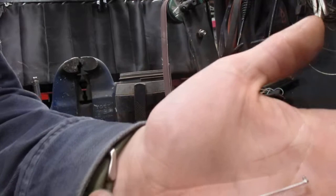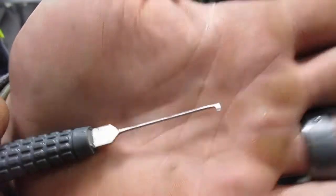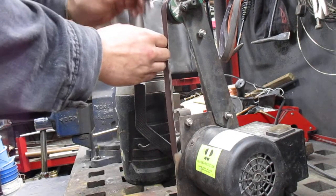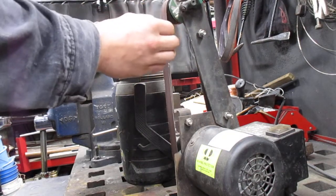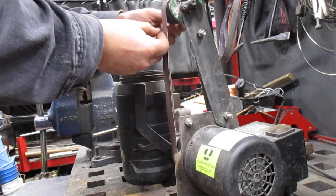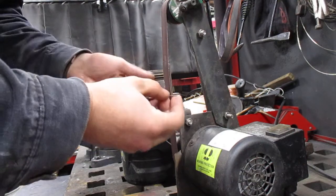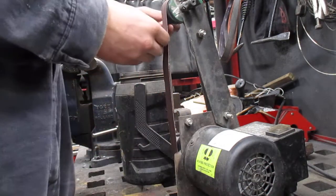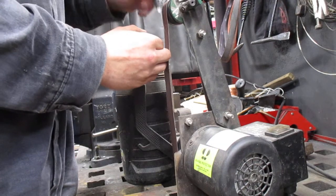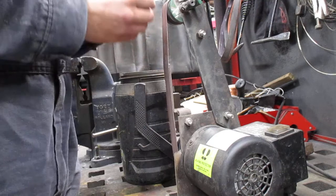So here's what we've got so far. As you can see, it's pretty well-rounded. There are a few little bumps here and there, but our next step is going to be to take all the sharp edges off. We're mostly working at a right angle to this belt, so it's going to leave a lot of right angles on your tool — we don't want that. We want rounded edges so that we're not digging away the brass pins inside of your lock. So just a few swipes here using a piece of sandpaper on a flat surface.